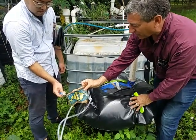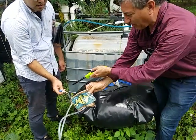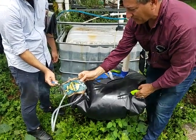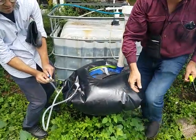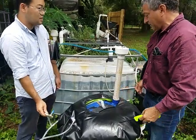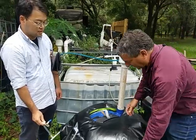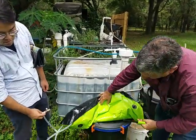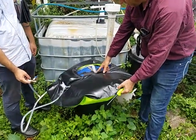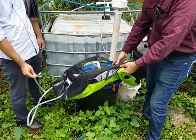This is very simple. How much did this cost to make? Oh, less than $100. Less than $100, right? And most of that was in parts like the brass fittings and the other fittings. So very simple. This is a viable solution for people in areas where they don't have much to work with — like school kids who want to get the idea. It's just a garbage can, and then there's another garbage can put upside down in it with a hole and a bulkhead fitting. There's a feeding tube that goes down the side, you feed it, you get gas, and you store it here.